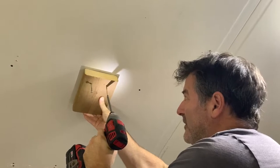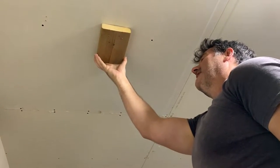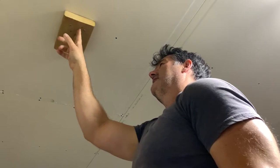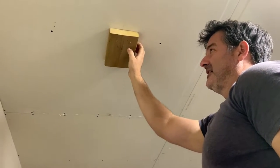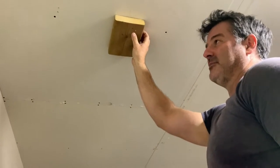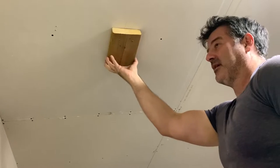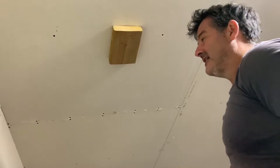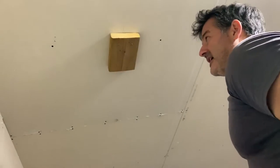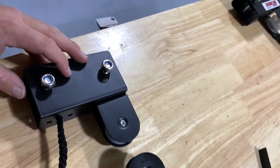We marked our center line at two feet and we're driving the screws into our ceiling joist for a solid mounting point. We'll space the legs out — one here, one there. Construction screws like these usually hold about 85 pounds apiece, and since we're lifting a 35-pound kayak, we've got more than enough bracing on each end to do that safely.